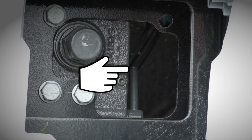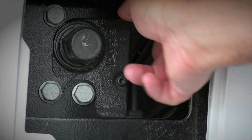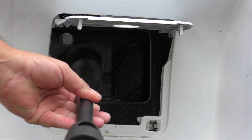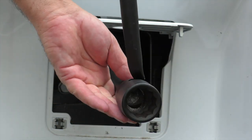On vehicles with a manual pump, open the control panel flap and move the hydraulic pump's direction lever into the tilting position with the top of the lever pointing outwards. Using the wheel brace from the vehicle's tool kit, operate the pump manually to raise the cabin.